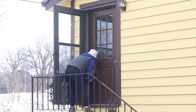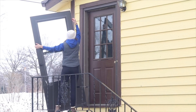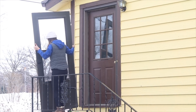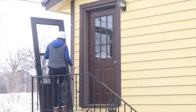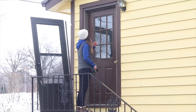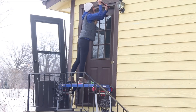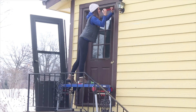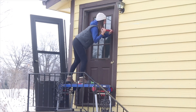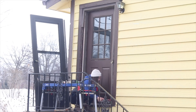The first thing I did was remove the screen door — I just removed all the screws on the framing that held it into place. I've never done anything like this so a lot of this project was just trial and error. You can see here that I'm just sitting considering what's the next step because I don't really know what I'm doing, but I'm going for it anyway. So the next thing I decided was to remove the brick mold. I didn't remove the extra exterior wood that was around the door frame because I think that will get done later when I patch the siding.